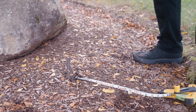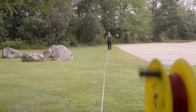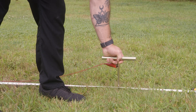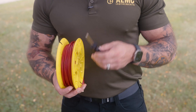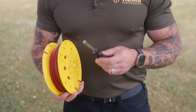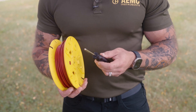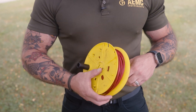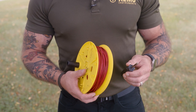I've run my tape measure out 100 feet. Next I'm going to install my H electrode out at the same distance — that's 10 times the length of my ground rod — and bring that back to my instrument and make the connection. To make your job easier in the field, AEMC includes a reel spindle with all of our reel accessory kits. This simply snaps into the reel and can be released using the release mechanism.